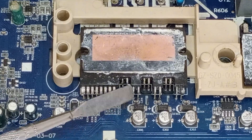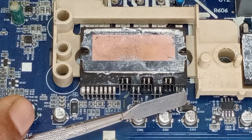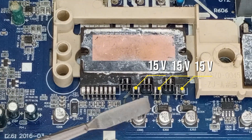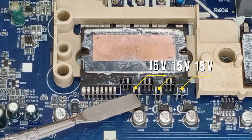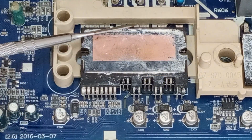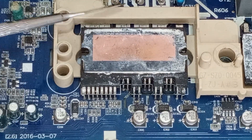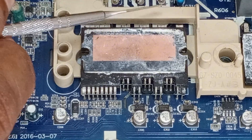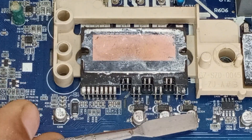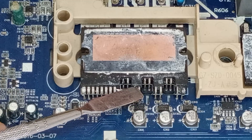The next are pins 11 and 12. These pins, along with all the other external pins, serve the same function. They receive 15 volts and function to provide feedback to the IC inside the IPM regarding the output going to the compressor. This feedback helps determine how the compressor is being driven, its position, and its speed. These six pins, along with the three capacitors, perform this feedback function.